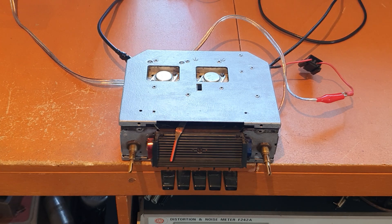Now we'll go through some of the parts I replaced and what I found. Firstly, those output transistors — they are currently AD149s, but they started off as AT1138s. This radio is full of Australian transistors from the late 1960s, and they're all silicon transistors except the output stage, which is germanium. They didn't have their act together making high-power silicon output transistors in the late 1960s, so they were still using germanium. They're both PNPs and were tricky to diagnose as being faulty.